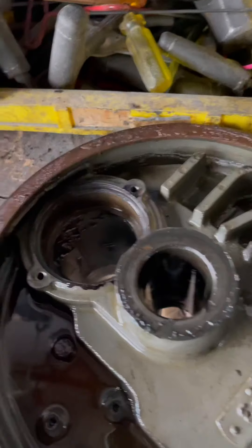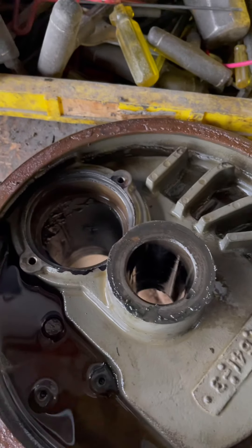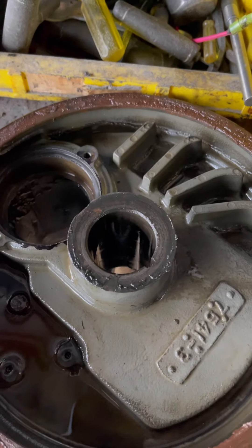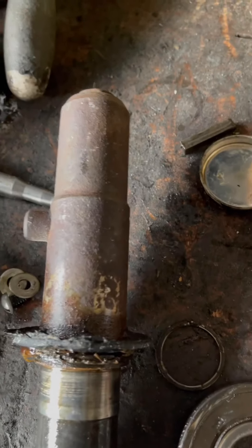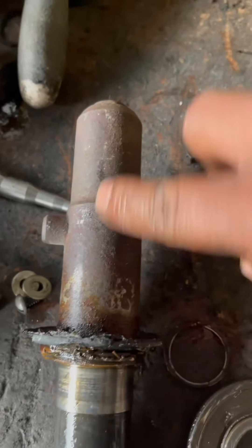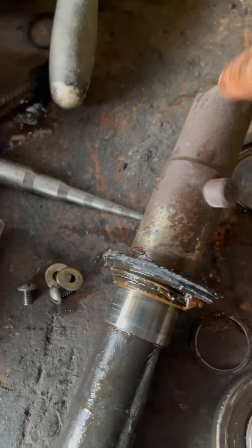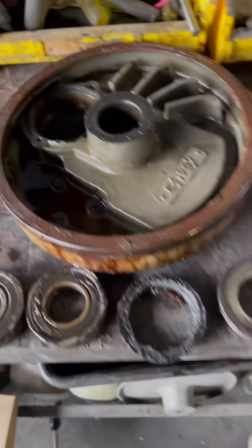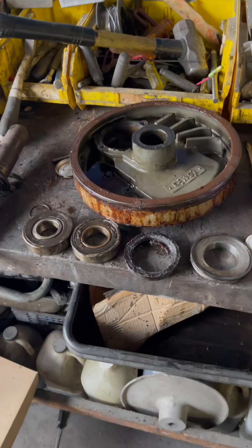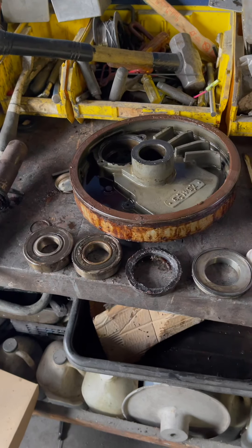This planetary will be entirely cleaned with gasoline. I recommend using gasoline to give it a pretty good clean up. I will also wash this shaft and then polish the section on the shaft where the attachment attaches — so this needs to be cleaned. And basically that's the process of disassembling a 60 or 80-core, models H600 or LA100, planetary.